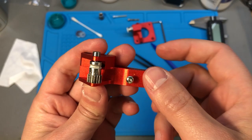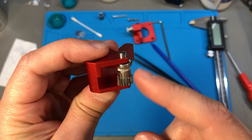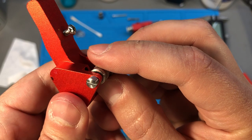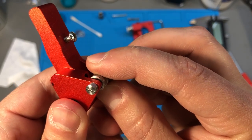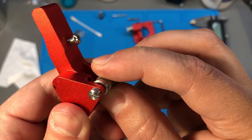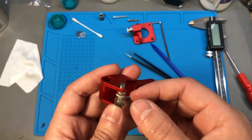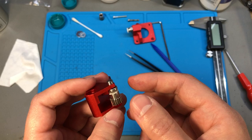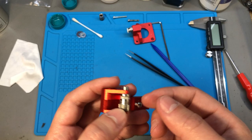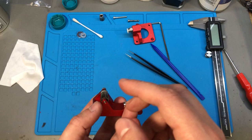Here is the mechanism back together — it seems to be running smoother now. The cogwheel doesn't catch on the aluminium base anymore because it's sitting perpendicular now. The new axle is a tight fit; there is just the tiniest amount of axle play, but that could be the tolerance or wear on the bearings from running on that M3 screw for so long. It certainly doesn't feel like a problem anymore, and if I wanted to I could correct it with a new axle that's 3.1mm wide for the entire length, or order a new set of bearings.